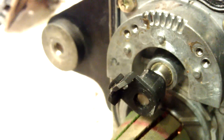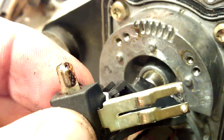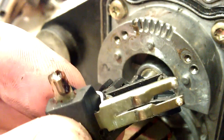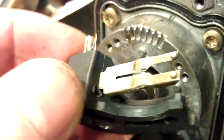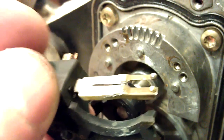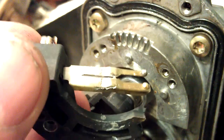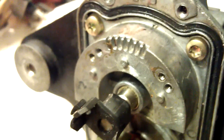The micro switch itself is extremely brittle, so it broke. Here is where it used to touch — as you can see, it even went through the metal a little bit, but just polished it rather than actually taking metal off, because obviously the plastic wore off faster than the metal. The contacts themselves are still intact after cleaning.